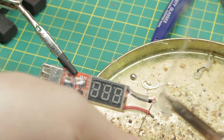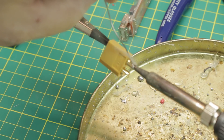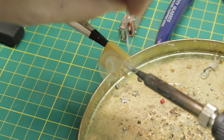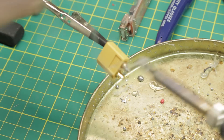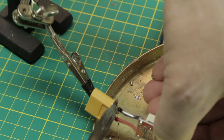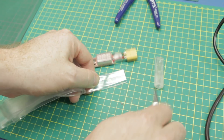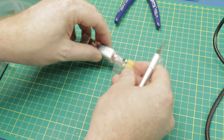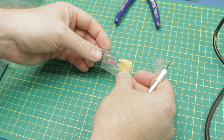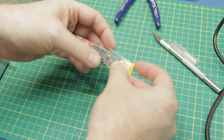It's really hard to solder from behind a camera, but yeah, it'll do the job. We'll put some solder on the XT60 connector. You pretty much just need a big glob of it. It is hard to heat up an XT60 if your iron is kind of weak — mine is not, so it doesn't have too much trouble. Now if you have some heat shrink, that makes the rest of the job real nice and easy. We'll go ahead and take a good-sized chunk and run it right up the XT60, then shrink it down.